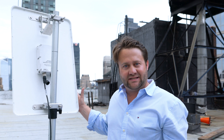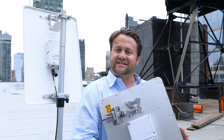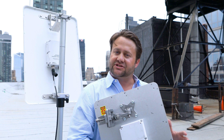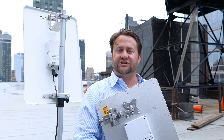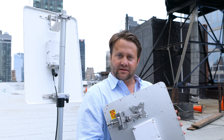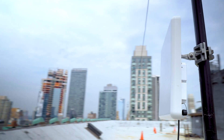This antenna is a 3x3 sector antenna that covers 120 degrees. Inside of it you have 12 dB of gain paired with the 10-watt radio card that normally sits on the MPU5. This is our C-band integrated patch antenna, which allows us to connect buildings, towers, and static locations over a large geographic area — it's a 23 dB antenna powered by a 4-watt C-band radio with a 9-degree beam.